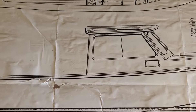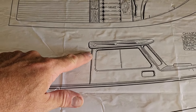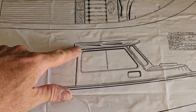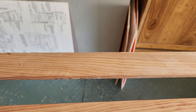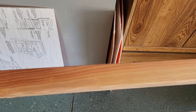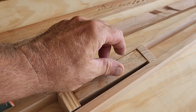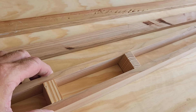Since I'm not going to have a back wall, I have to deviate from the plans. To make this curved arched roof, I'm going to have to make an arch beam. What I've done is rip this Douglas fir one inch thick and one and a half inches wide. I'll put two of them together with one and a half inch blocks, space it out with a spacer, and sandwich it together by gluing them to make a beam.